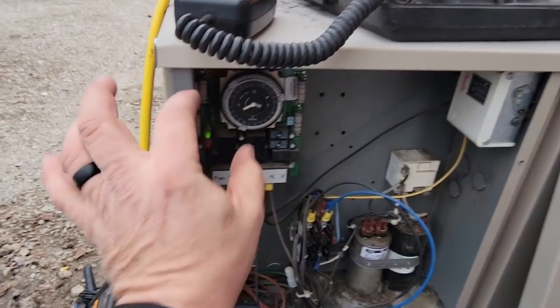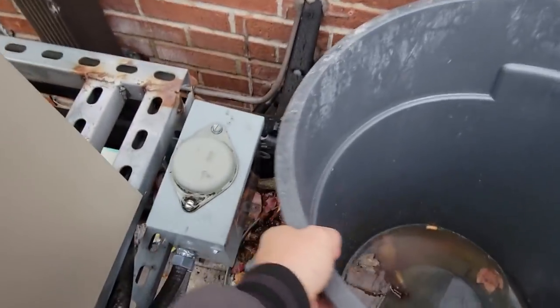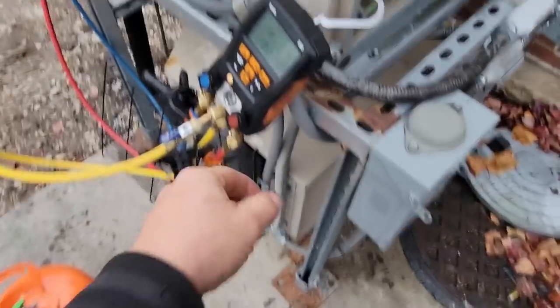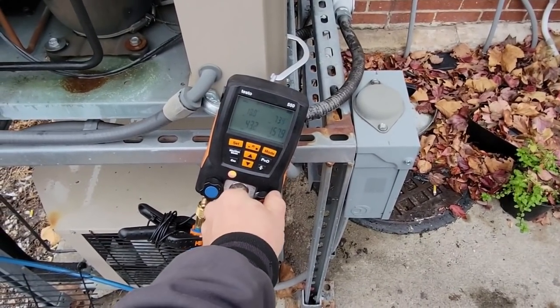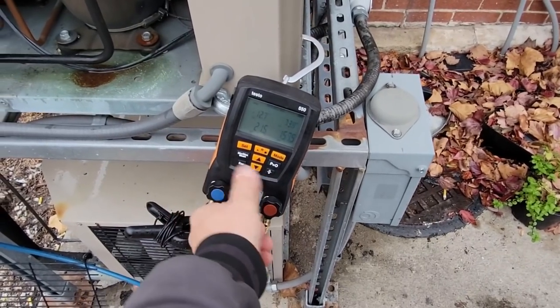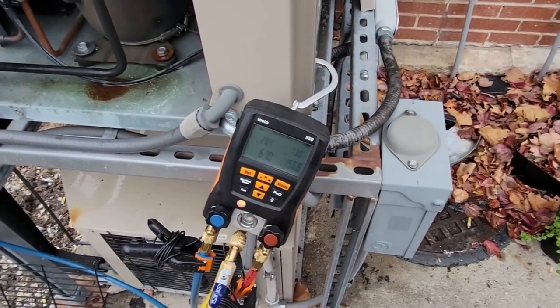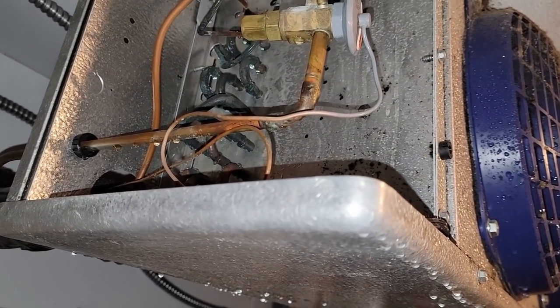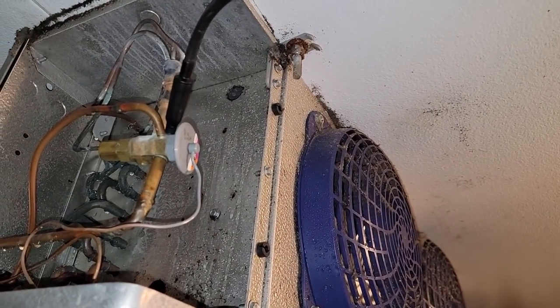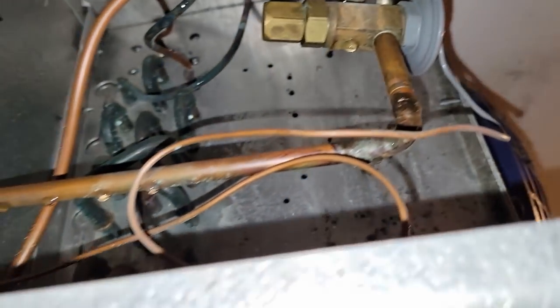Let's pump it down one more time and go down and scan it for leaks. We've got 13 pounds on the suction — let's turn that off. Let's just dump a little bit of liquid back into that suction line and raise that up a touch so we don't have a full load of liquid in there. There we go — 65 pounds, that should be a good start. Scanned outside on the condenser — I think we've got a little leak on the head there.